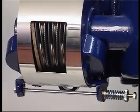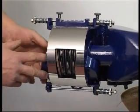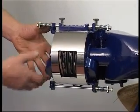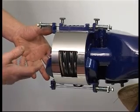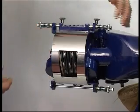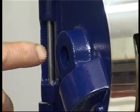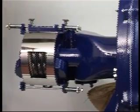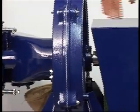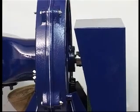Maintenance of this machine is quite simple. Now and again, perhaps every other day, take this side door off. You can remove the plates quite simply to make sure that this is not blocked up with feathers. On putting it back together again, half a pump of grease on the grease nipple here, and moving around the other side of the machine, there are 2 grease nipples there, and half a pump on those per day if you're doing a lot of work.